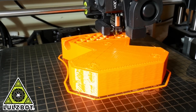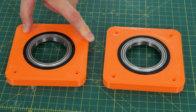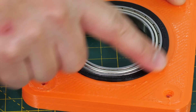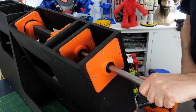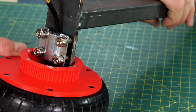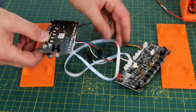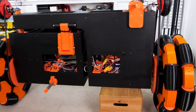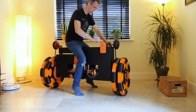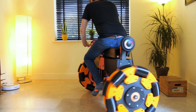That's great for printing large parts quickly and with a good amount of strength, but it's tough to get tight tolerances. To overcome that hurdle, he's printed these inserts with a smaller diameter nozzle, which helps the part get a good interface with these bearings. The frame pivots in two halves around this central axle, similar to the way a hoverboard does. Each wheel is driven by the hub motors from the hoverboard, and their output is directed by the orientation of a pair of IMUs. It's definitely a bizarre setup, since it's easier to get the bike to spin on its vertical axis or shift sideways than it is to get it to move forwards and backwards. There's still some stuff for James to figure out, but it's a cool project all the same.